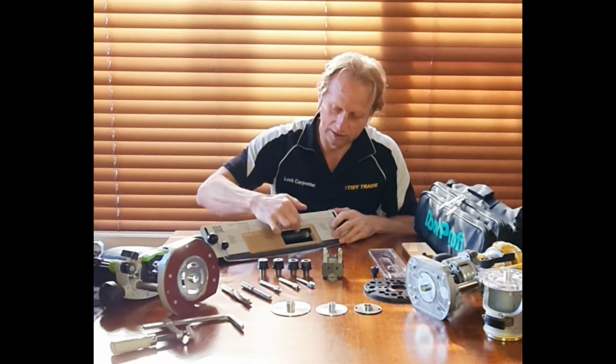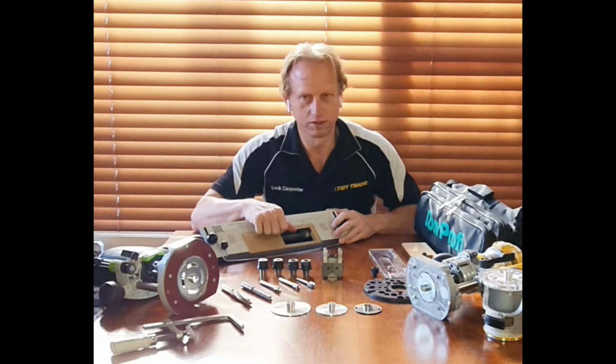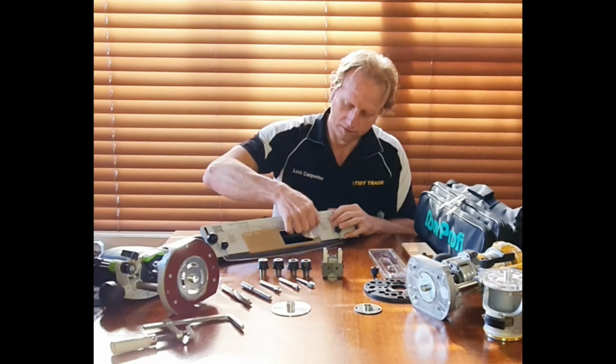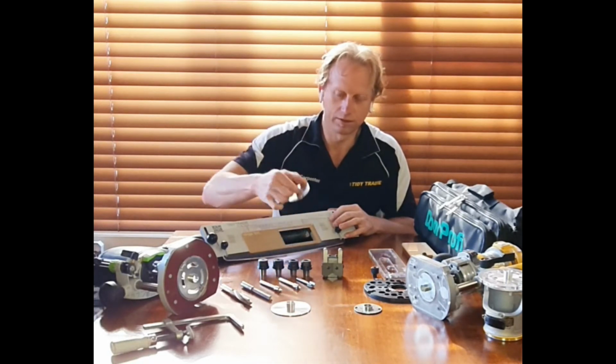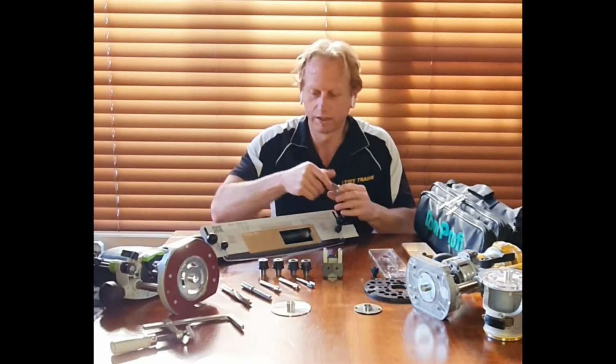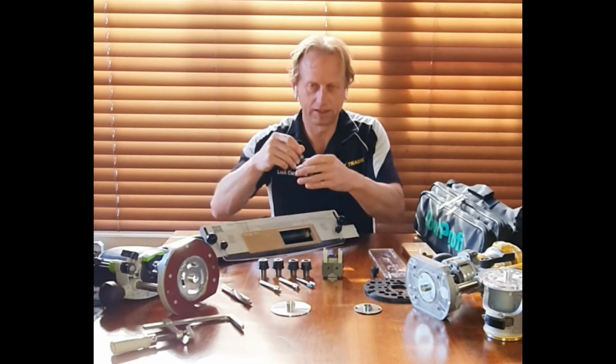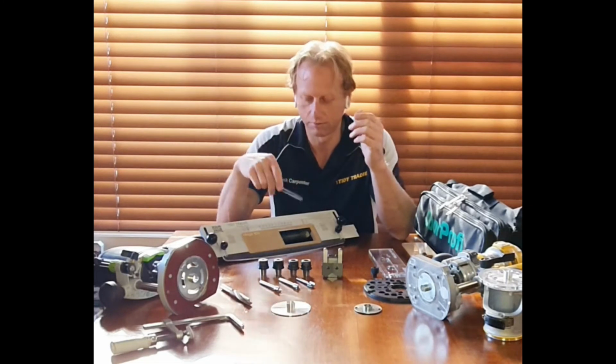You're not going to accidentally cut the edges like when you're using flush cut bits, because you've always got this thing protecting. So you can't damage a template. You'd have to leave the cutter hanging out and then accidentally pull it out and nick the side or something. Once you do that, template's hopeless.